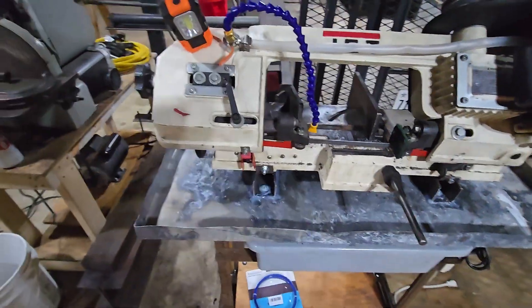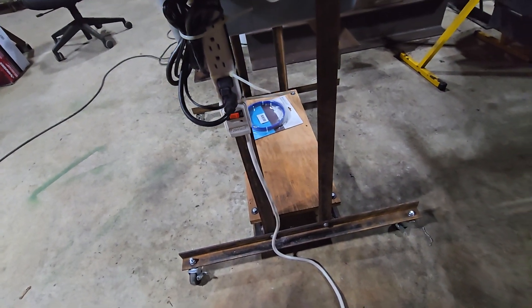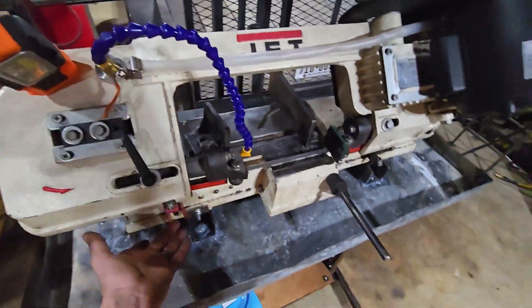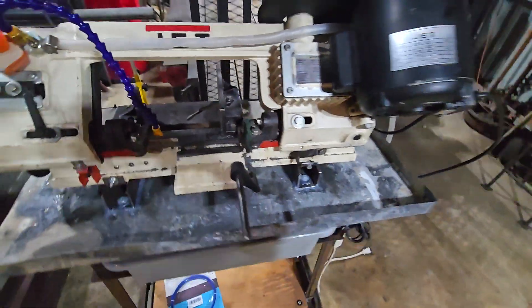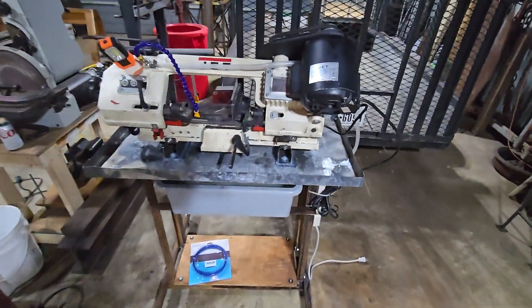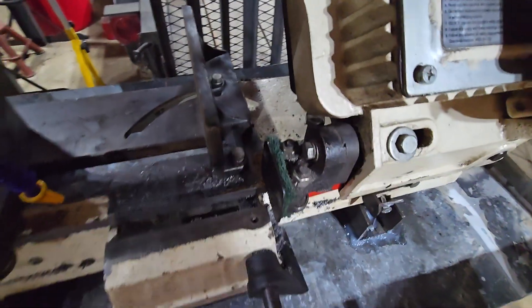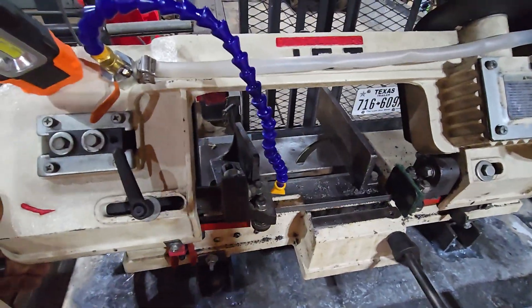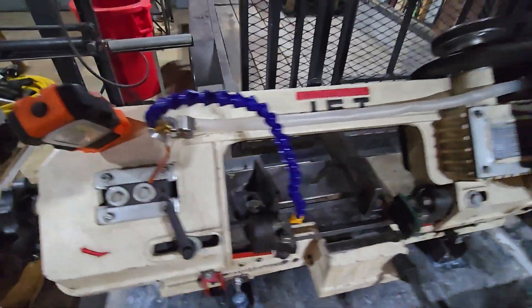I built the pan big enough to go all the way around so if it drips anywhere it's not a problem. The switch is up out of the water and I just use a surge protector as the on/off switch, with the pump plugged into it as well. So when I turn it on, the pump starts before the blade does, then I turn the blade on. The only thing I didn't account for is that when the arm folds back it touches the pan, but it doesn't bend it so I'm not worried. I put a little pad in here to keep shavings out and deflect water, so now it all drips back into the pan.